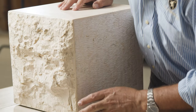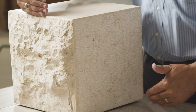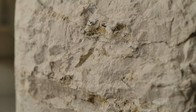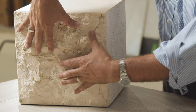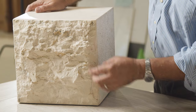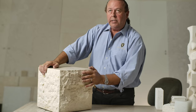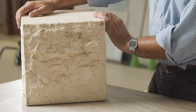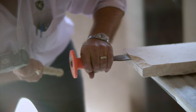This here is a split-face finish, which is also chiseled and gives you this bellied effect. You cannot do this with a machine — nobody has come up with a machine that can do this. It gives you a belly and it splits, showing the natural characteristics and natural strata of the stone. You can see this in many buildings in New York City, Washington DC, and many synagogues throughout America. We've done all of these finishes.